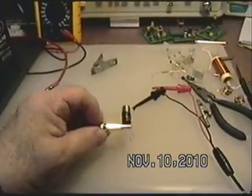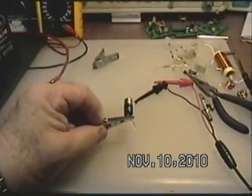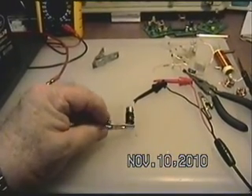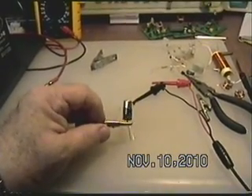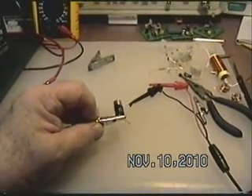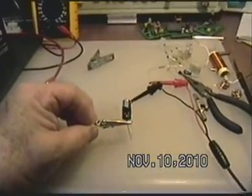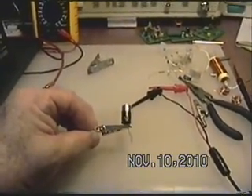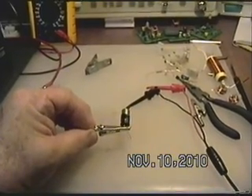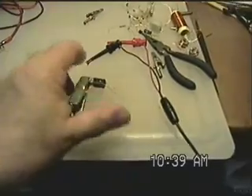So what I'm doing is I'm starting out at a baseline. I have a 10 microfarad 35-volt electrolytic made by Nichicon. To start out, this particular capacitor is being shorted for 15 minutes with an alligator clip lead, and when that's done, I'll come back and show you the next test so we can set up our baseline for our observations.